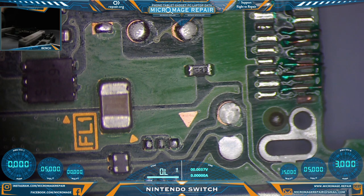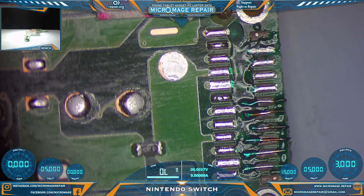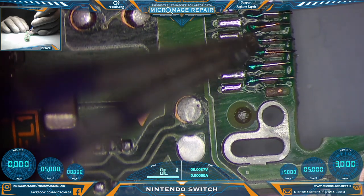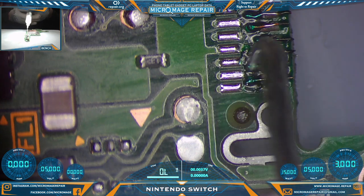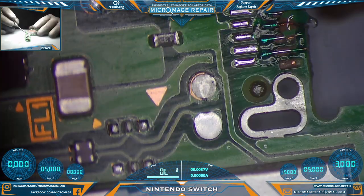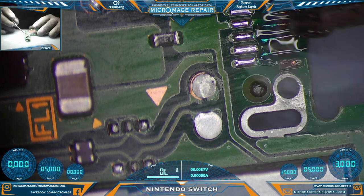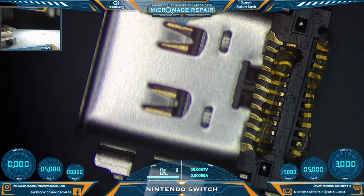Okay, let's cure that area again, and I'll just let it cure for a little while. Again, I want it to be nice and secure, and then we'll try and tin it and make sure it doesn't get sucked in the iron and go from there. Okay, it's been curing for a while, so I believe we should be solidly back in place. Let's tin that one, make sure it doesn't get sucked up in our iron again. Yay! And we have successfully tinned that one.